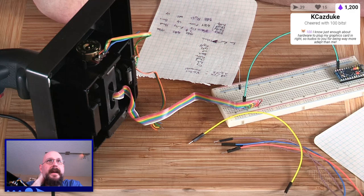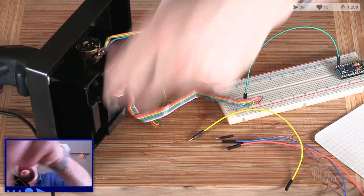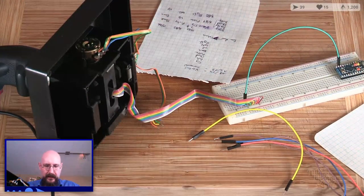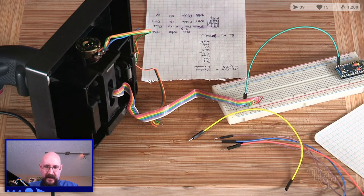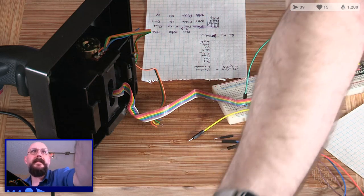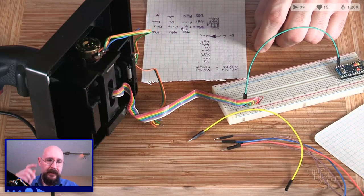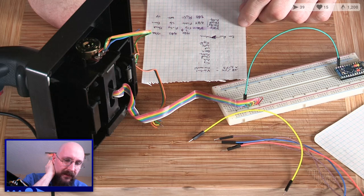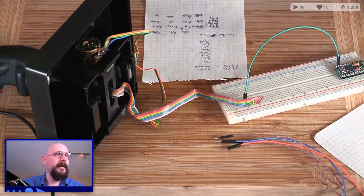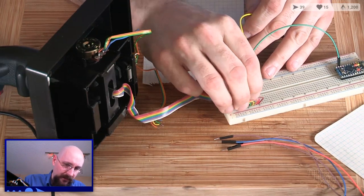Yeah, Drowsynth, I think you're right. I actually don't think I need to multiplex it on this, especially not for this many buttons. So why don't we attempt to do that without that? In which case, this matrix is unnecessary. But it's still on a common ground, which is not a problem anymore, right? Right, because we've got a common ground. So I'll take that back to the ground,